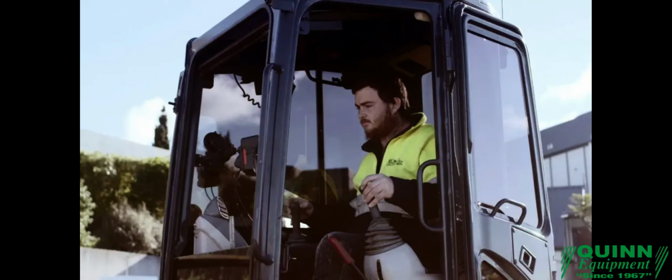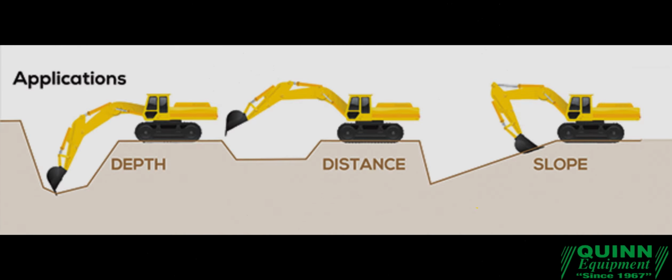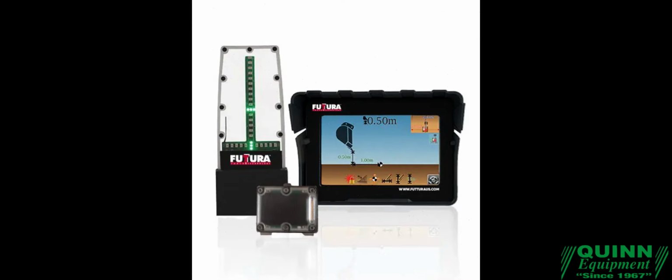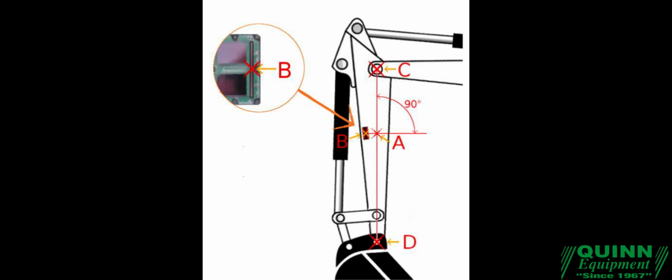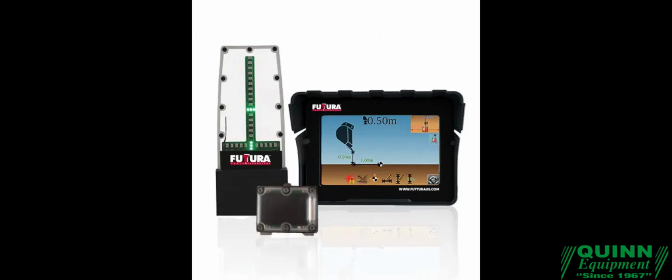Tape measure. Make sure the unit of measurement selected for the system matches your equipment on hand. Magnetic plumb bob or magnetic hooks. String line. Clean rags. Brake cleaning fluid. Tripod, preferably an elevating variety. Window cleaner. Rotating laser and handheld receiver. Make sure your sensors are charged. Grade rod. Cable ties, conduit, and sticky cable mounts for a clean cab.